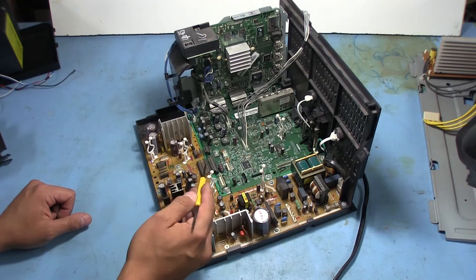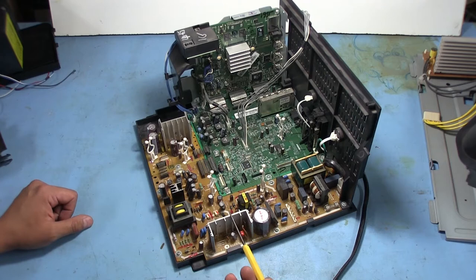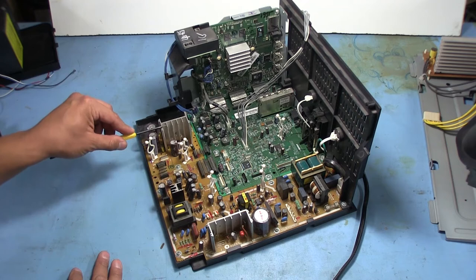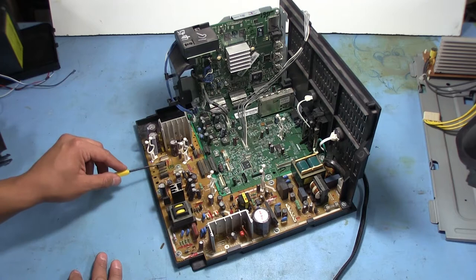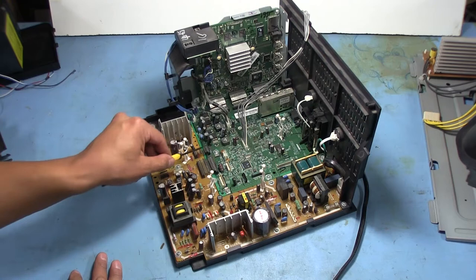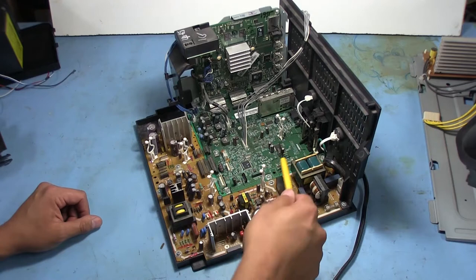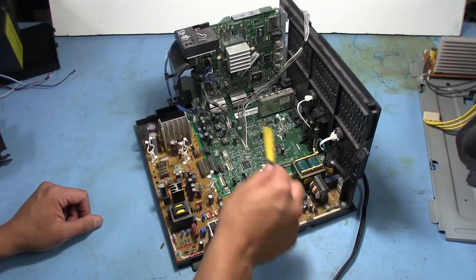This board here is kind of shaped like an L — it ends right here where these two connectors are, and then it's just L-shaped. That's probably going to be our switching controller. We've got a few little transformers here and our big cap right there. There's a big jumper here and a small one going to these boards. This board right here is our audio amplifier for the speakers. This section here is the power going from the power supply to the amplifier, and this right here would be our audio signals. This section here is all the power supply for the big board, which is our interface board with all the inputs in the back.